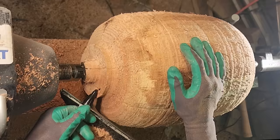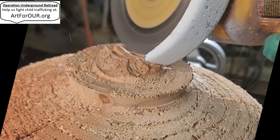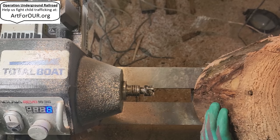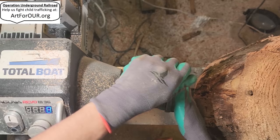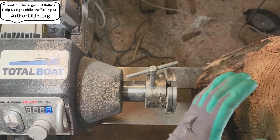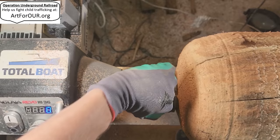You'll notice as I go along that I had a much longer log than wide, meaning if I was going for a globe, I was going to waste a lot of wood. And I knew that going in, but I also knew that I needed to do two different resin pours to create the ocean and then the cloudy layer of the globe. And I needed some ridges where I could connect my plastic sheeting to create a temporary mold for the resin, to limit the amount of resin waste. And so that's why I left quite a bit of wood on there, so I could have plenty of room to work, plenty of places I could attach and then destroy later.